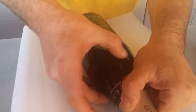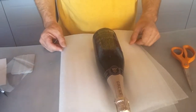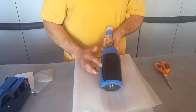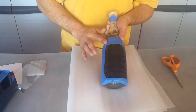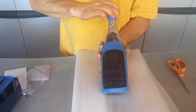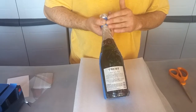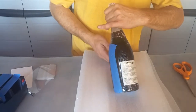So at that point, I think we've got it down pretty well. The next step is to basically mask off the rest. Once you have the stencil on, you want to mask the bottle to avoid any overblast. We used just your basic blue painter's tape to mask around it, and I've actually added an extra layer of protection by using a plastic shrink wrap to go all the way around the bottle, just to make sure that it stays nice and clean and pristine through the blasting process.